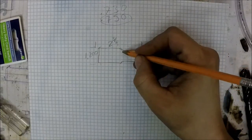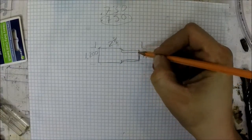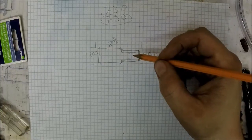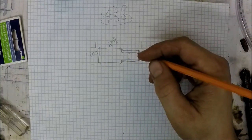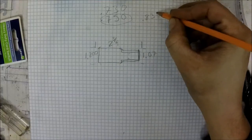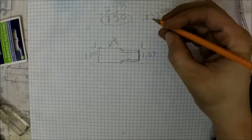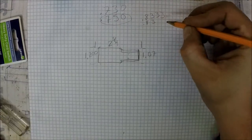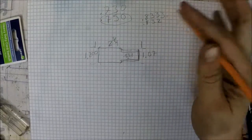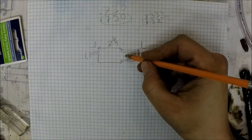And then I'll make a shoulder inside, and this shoulder here is machined to fit a specific shotgun. So the one that I'm currently doing, the shotgun is 0.8333. So I want to go 1/1000th under that, so I'm going to machine it to 0.832. And I'll try to hit as close as I can to 0.8320. So this will be 8320.